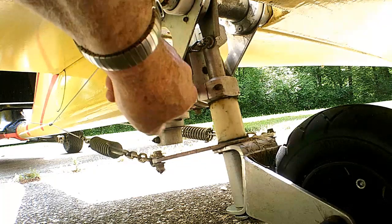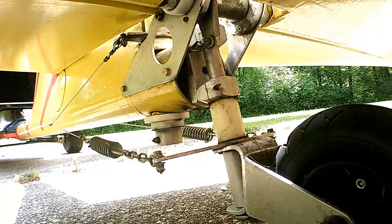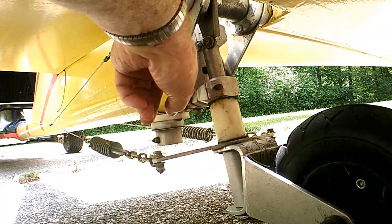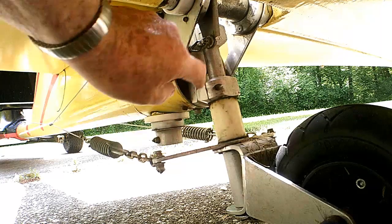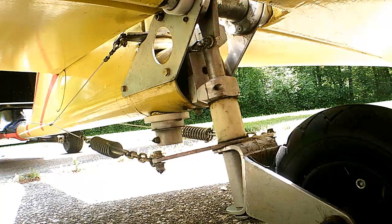This angle that I put on here is nothing precise. I just wanted to make sure I had an angle on it a little bit. So I just put it in the chuck jaws in the lathe and cocked it at an angle. I can't tell you how much it's off, but I'd say it's about a quarter of an inch from one side to the other, cattywampus. And then I just turned a little step register and put it on there. And these holes I drilled and tapped in there are what's holding that block in there. The knee screws, these little saddles, clamp this business together. That was all there was to that. So that's something that probably looks different and makes it look different, the way it's set.